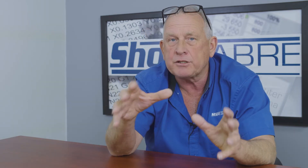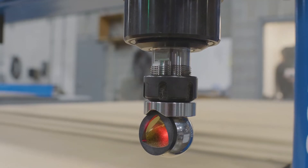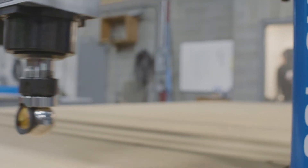Once we assemble the parts and we have machine motion, that motion creates the work envelope. What we're interested in is what shape is that work envelope and how accurate is it? First of all, you have to have a way to measure it, so we use a Faro laser calibration system that's accurate to six decimal places.